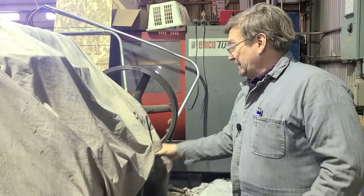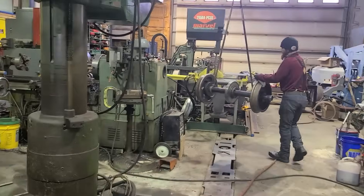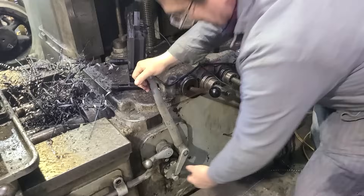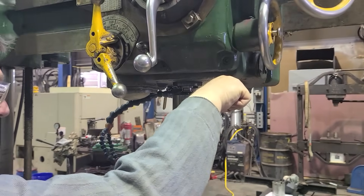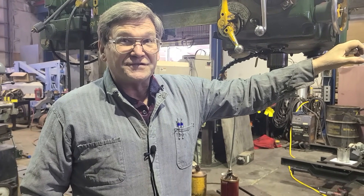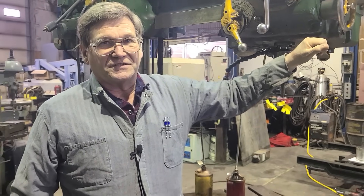We have clutches on a lot of our machines. We've got one on our boring mill too. What does have clutches? This one here has clutches — they're manual. There's a lockout there. This allows you to go one way; turn it over and the clutch will go the other way, or leave it in the middle and you can go forward or reverse both — it's a manual lockout mechanism. Also on a lot of this stuff, positioning a little bit — well, you don't run the machine that way. You can position it, but when you kick it in gear, it should have a snap. It should go over-center and apply hard pressure to the clutch so they don't slip. While you can move the spindle by just touching it, you never want to run it that way. You'll burn up the clutches.